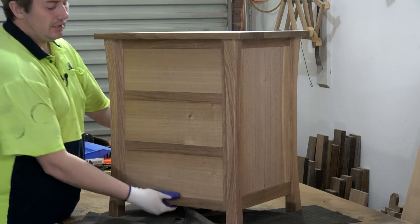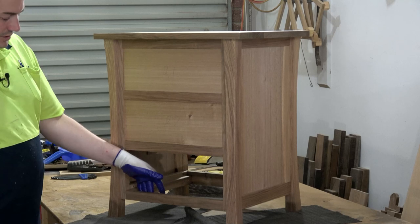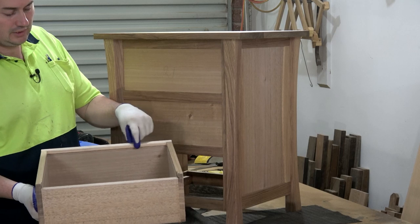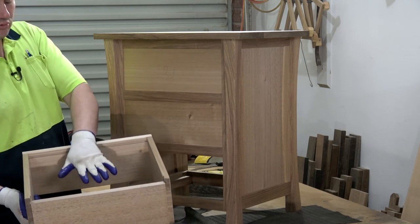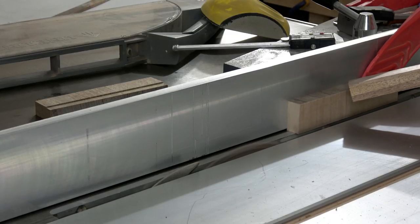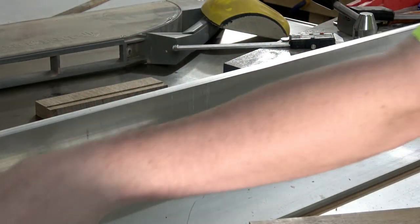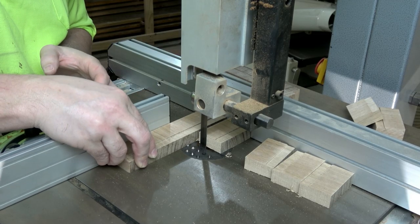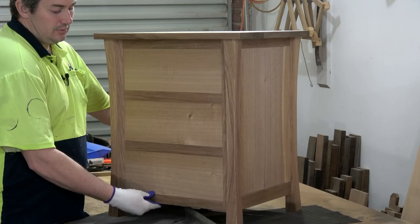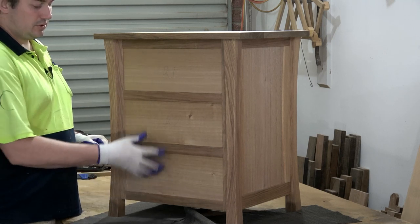In order to achieve that, all I need to do is put a couple of drawer stops behind this frame that will hit on the bottom lip of the drawer when I put the drawer bottoms in, and it'll stop it at the correct point. I need to put a little rebate on a block of timber — one and a half mil back — so that when the drawer goes in, it gets to flush and keeps going 3mm back, hitting the drawer stops perfectly.